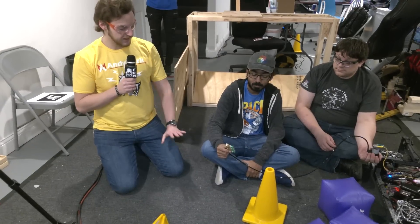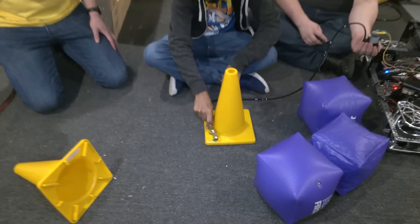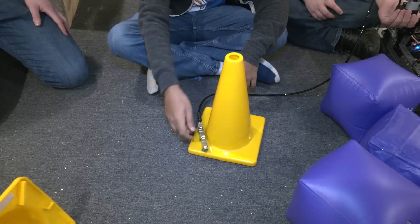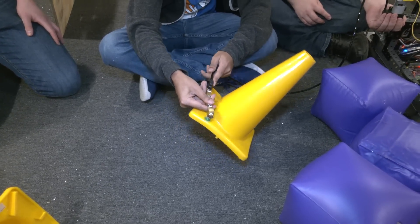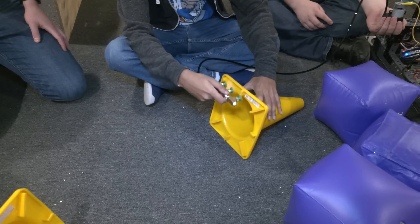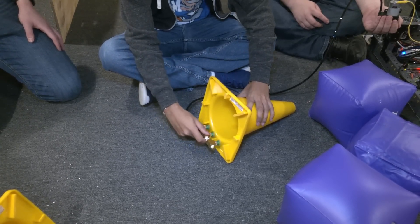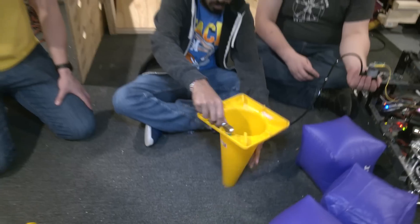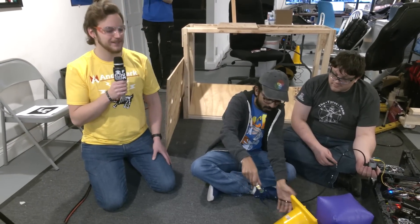So this is another test. We're going to try attaching the suction cups to the flat flange of the cone. As you can see, the moment might be a bit too much for the suction to overcome with this configuration. But if you had more suction cups, I imagine it could work. The tilting moment of the cone is tearing one edge of the suction cups away, and then obviously they can't maintain suction. Well, I guess that works — never mind, this is implementable.